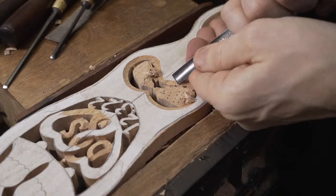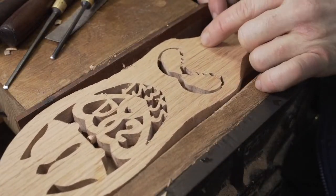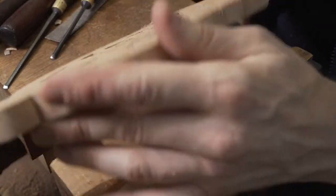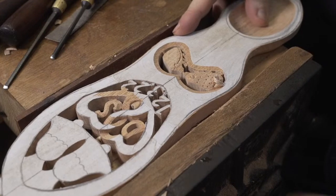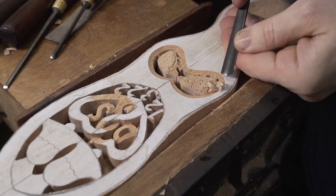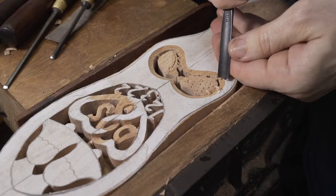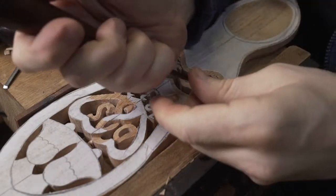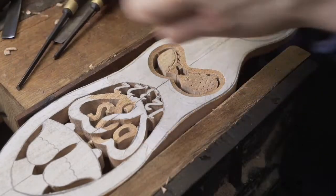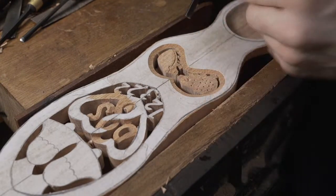So far, so good with this piece of oak. When we're marking out, one little pointer - we always check the wood, have a good little look through. You can see there's a little darker patch there. We also look on the top and on the ends. Just check that there's nothing to be too concerned about. Because it's far easier if you can get things marked out correctly. It can be really frustrating - you'll be working on a piece and there'll be a blemish in the wood, sometimes completely invisible. And the next thing, you start carving through it and you bring out the blemish. Always have a good check on the wood for anything that might cause a problem.